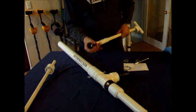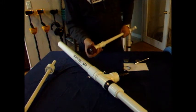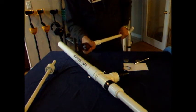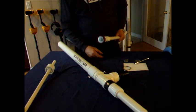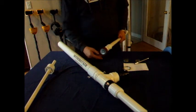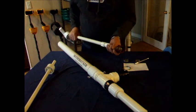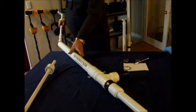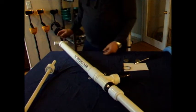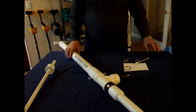Make sure the extension is snug so it doesn't rotate inside under pressure and unscrew itself — same with the seal. That's why water pump pliers are important: PVC-to-PVC binds well, and you're better off having it snug than having it come off mid-upstroke. Then fit the assembly back into the barrel and tap the cap on snug.